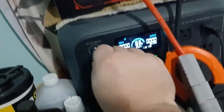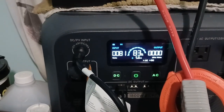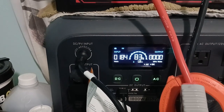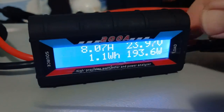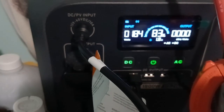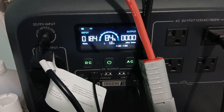I'm going to plug in with the solar connector. Looks like I might not get more than 184 watts — it's keeping it at eight amps. You can see it's still slightly below 24 volts. This is 193 watts converting down to 184 watts, so about a 9-watt loss. 194 in and 184 out.